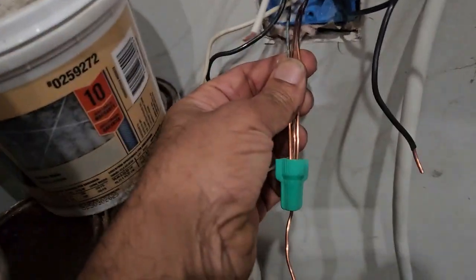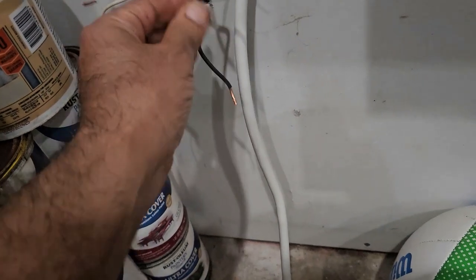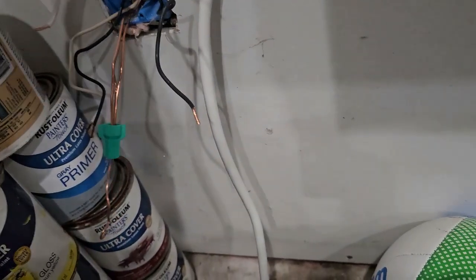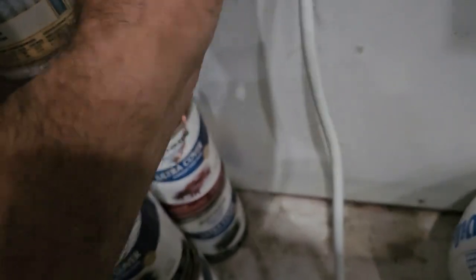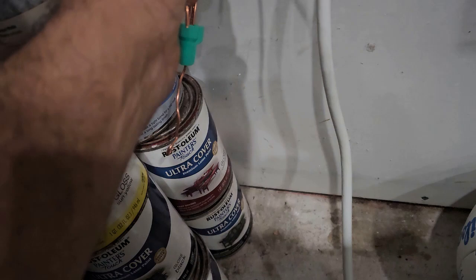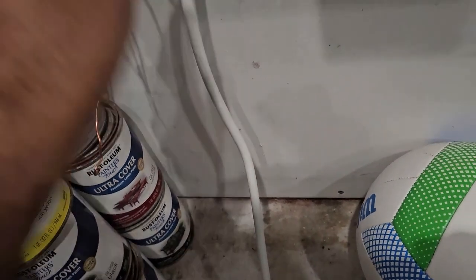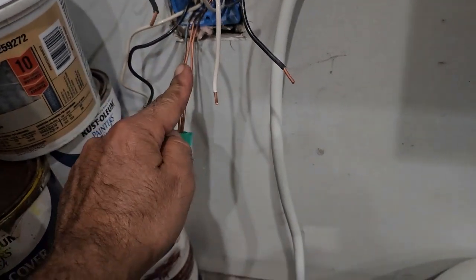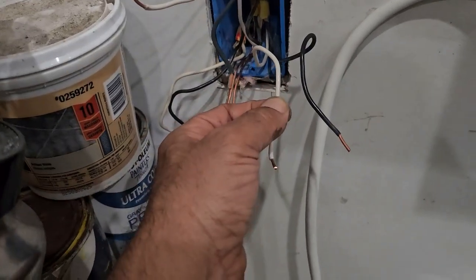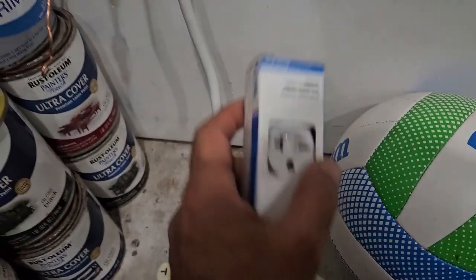To do that, these are all ground wires together. This was 110V running right here and I had to piggyback to another outlet from here. I'm going to find out which wire is the main wire coming in from the back. These two are together here — this is one wire and this is the second wire. The ground wire I'm not so much concerned about. I'm going to convert this wire into a hot wire, and these two would be hot, which will go on this outlet.